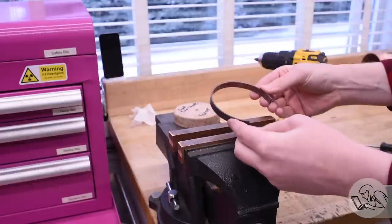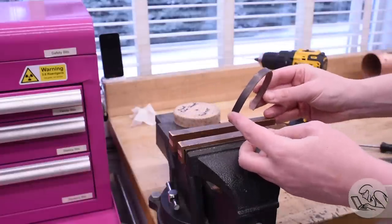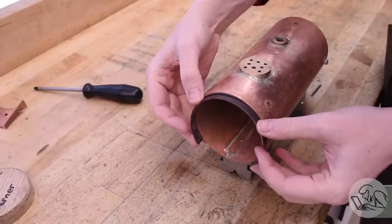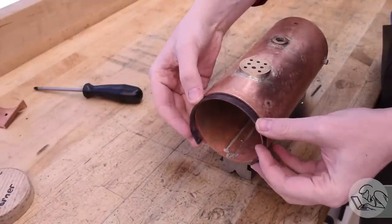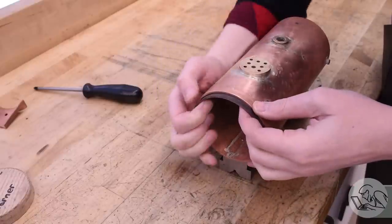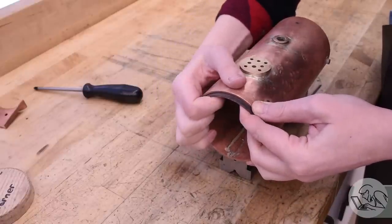Fancy sheet metal tools are great, but never underestimate the power of hammer forming, especially with copper, where once you've annealed it, it's just so easy to form with hammers and other simple methods. There's my little arch — shape-wise, it's looking very good. The crossways center line gets it centered on the boiler shell, and then the longitudinal center line allows me to get the strip exactly halfway into the shell, so those center lines are already proving their worth.